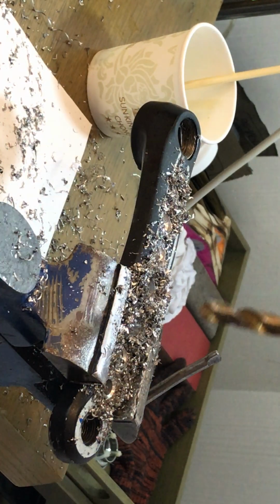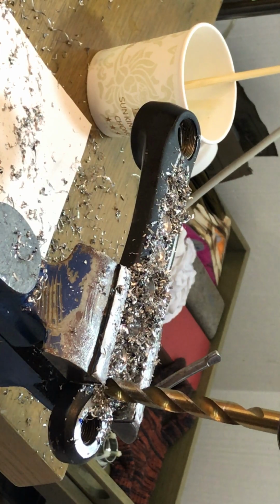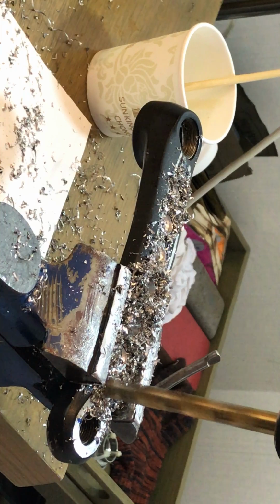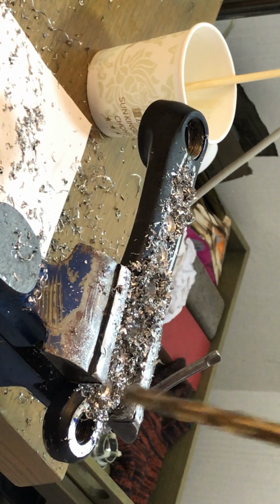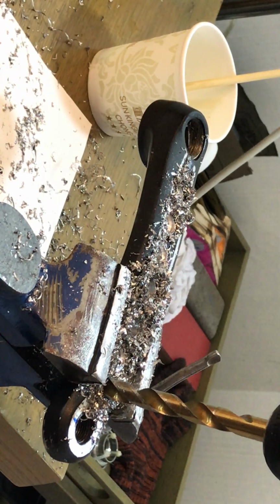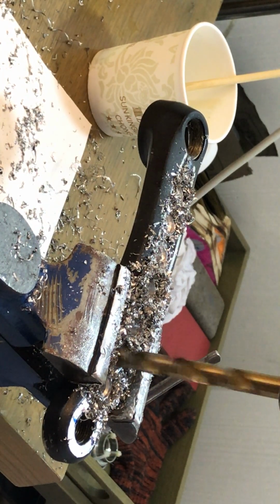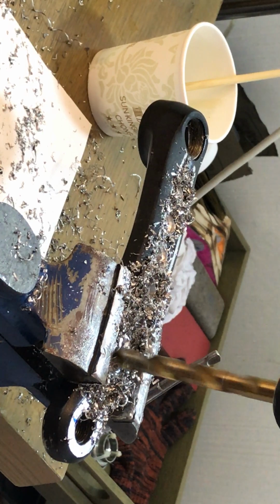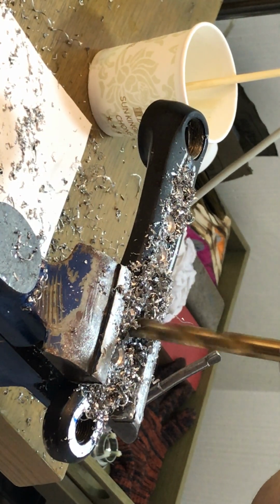Do I still have a fresh one? Okay, yeah, let's do the first one here. The first one is totally uneven, and it just rattles like mad. So let's see what happens in a minute. You don't take the pressure off, you go from rattling to smooth. See? Nice. So that's the first hole. I think the second one's almost there. Yes. Smooth as butter inside.